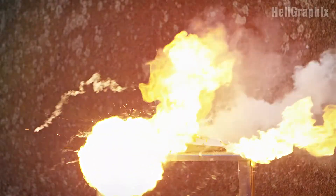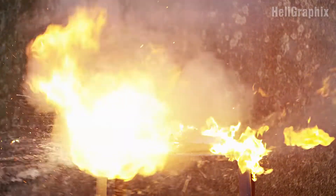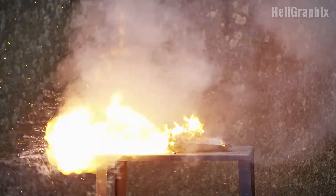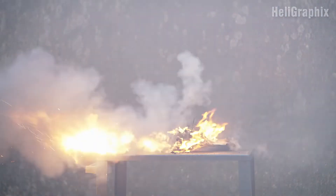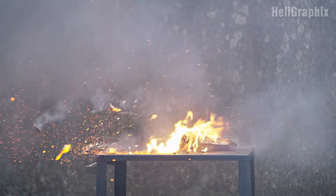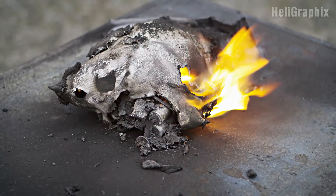In our test, we're using a fully charged 6S lithium-ion battery with 115 watt-hours of energy, so that's not even a really big battery. The difference between lithium-ion and lithium-ion polymer batteries is not a big one. Mainly, the individual cells of the ion battery type will go off one after the other, with fire coming out rather directionally, while polymers tend to go off more at once and in all directions. The fact we used a nail to start the thermal runaway has no significant influence on the outcome of this experiment.